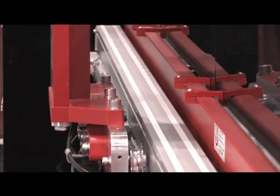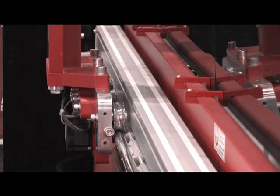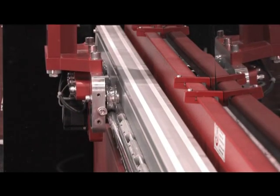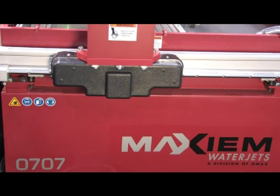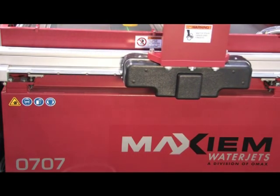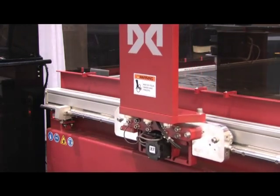This provides substantial benefits over the traditional ball screw system. The ball screw system works well in regular machine tools, but in an abrasive jet environment, a lubricated surface eventually becomes covered with fine abrasive dust, causing wear, premature failure, and loss of accuracy. This simply doesn't happen with the OMAX Inteletrax system. We're now using it on all of our Maxim models and on our larger OMAX models, and we predict this to be the linear control system of the future for abrasive water jets.